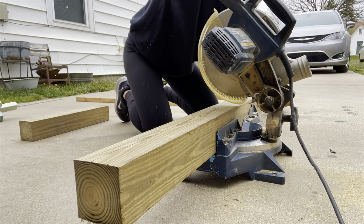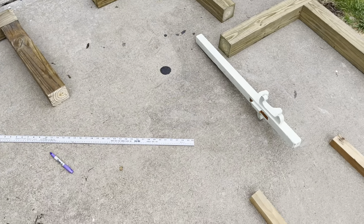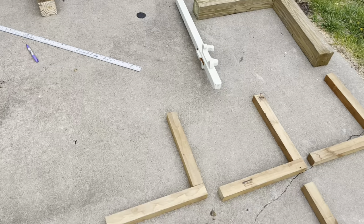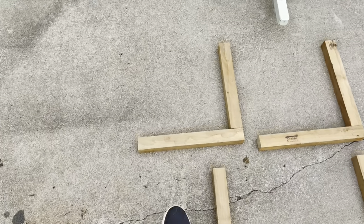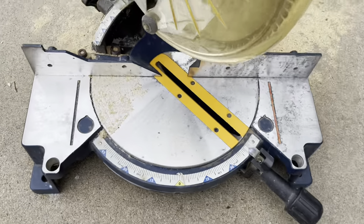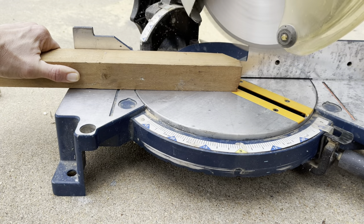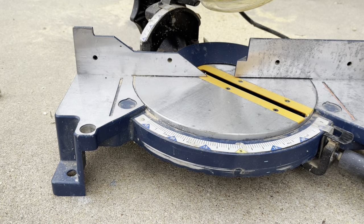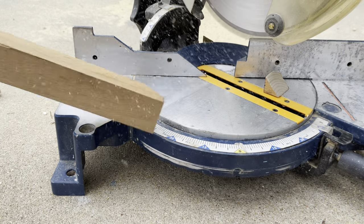The variation in sizes was just because that was the amount of wood I had. On the large ones I made a set with one single, and on the small ones I made two sets with a single — just how much scrap wood I had on hand. On each of these L-pieces, I'm now making a 45-degree cut. I just took my miter saw and swung the arm over to the side to make my cuts.